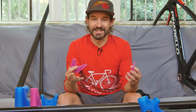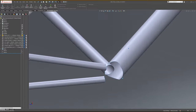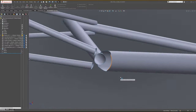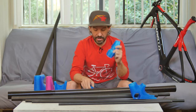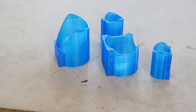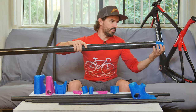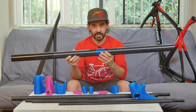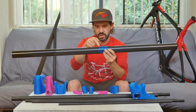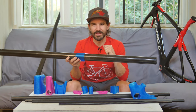With all the major components designed and printed, I can now begin assembling the frame — well, actually what I need to do first is cut the tubes. Some of the tubes require complex angles to cut and I don't have a proper chop saw, but what I do have is a 3D printer. So I 3D printed these guide parts that just slide over the tube — I'll trace that with a silver Sharpie and then go at it with the Dremel.